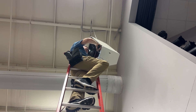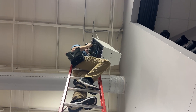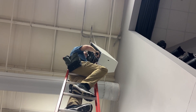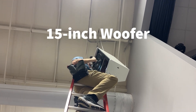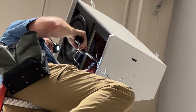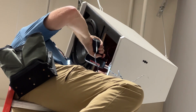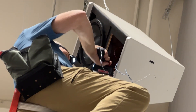We're over here on the left speaker now. He's soldering the repaired crossover board in there. The crossover board, if you're not familiar with speaker technology — we send the lower frequencies to that big 15-inch woofer that's right above Joel's head. And then the crossover board filters — it's a high-pass filter, so it'll only pass the higher frequencies over to the horn, which acts as a mid-range speaker and a tweeter. That's where we get our mids and our highs on that speaker.